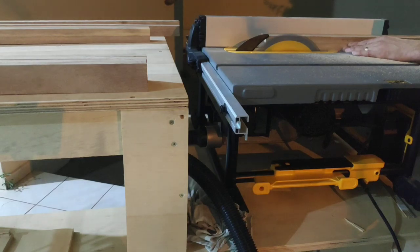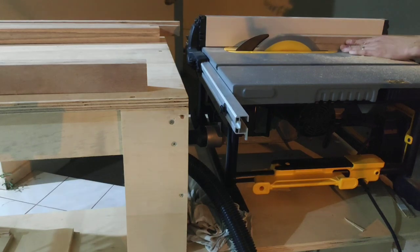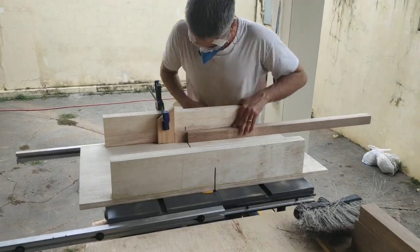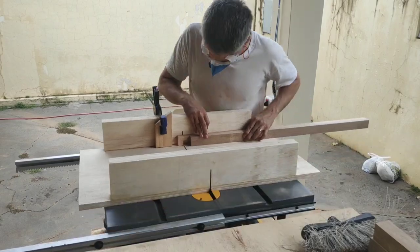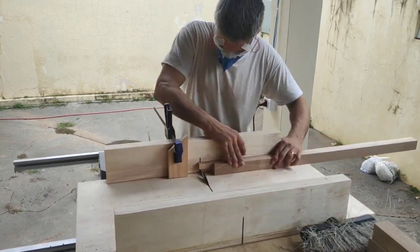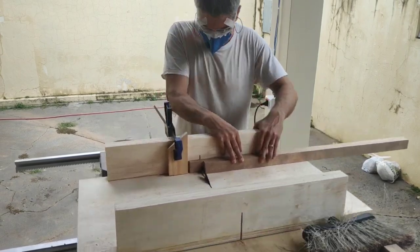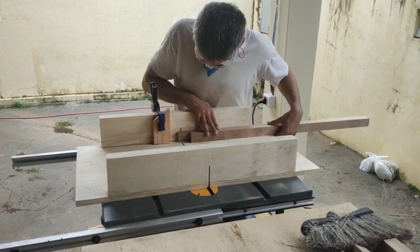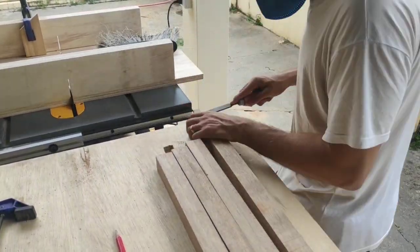When the legs dry, we take it to the table saw to remove any glue squeezed out. We could do it with a chisel, but this is much easier. We could do it with a planer as well, but that would require having access to a planer, so table saw it is. We then proceed to cut the joinery that will connect the legs together. We're gonna half lap the short strips, connecting the four legs on three of the four sides. One side will remain open so that the tower has an access point. Maybe this all sounds a little too abstract at the moment, but it should make more sense as the build progresses.